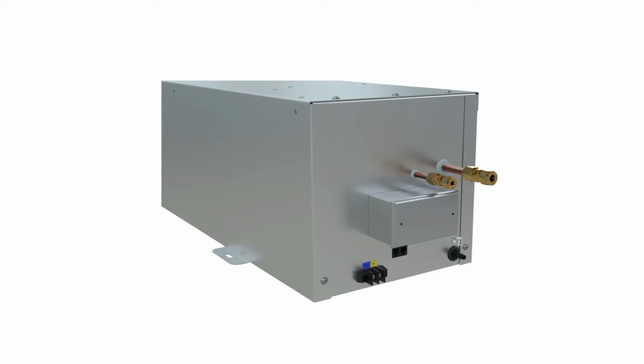Looking at the control end of the unit, the chassis has 5 main connection points. The first connection point is going to be the junction box, which is the main power source of the evaporator. It provides 115 volt or 240 volt for international units. Next, the refrigerant piping is a connection point that allows refrigerant to flow between the condensing unit and the fan coil, while the 24 volt connection is a signal connection that tells the condensing unit when to turn on. The control cable connects to the remote interface or to the remote sensor and allows for an advanced monitoring of the wine wall environment. Lastly, the drain connection is required to sufficiently drain excess condensation.